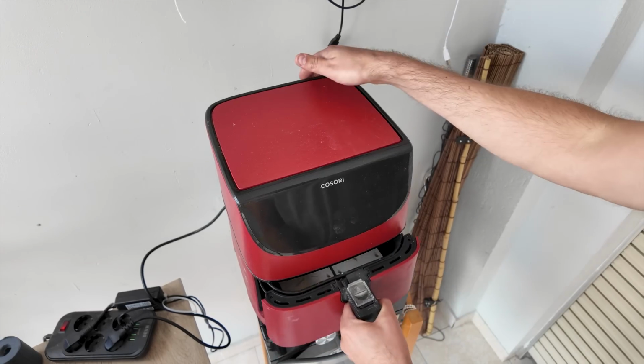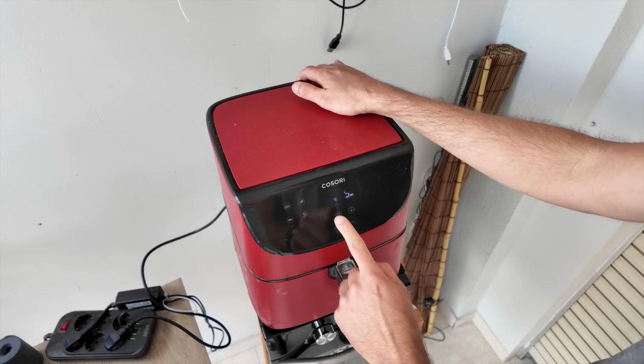I dried the mold in my air fryer. It is advisable to use a kiln, but if you don't have one, an oven or an air fryer can be enough. You see, burning out molds is not just about getting rid of the wax or PLA. You need to make sure that the mold is dry and doesn't contain any water. Bringing the mold to higher temperatures can make it stronger and decrease the chances of thermal shock. Ideally, you'll want to bring the mold close to metal pouring temperature. But for hobby metal casting, using an air fryer or an oven can work. Sure, the molds might crack because they will not be as hot, but that's just the way it is.